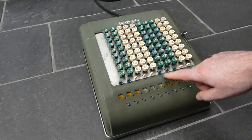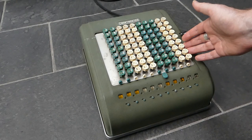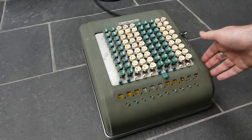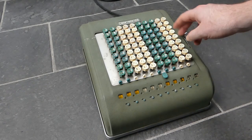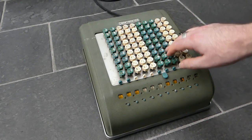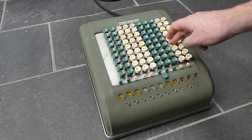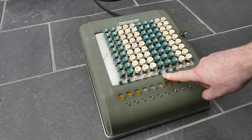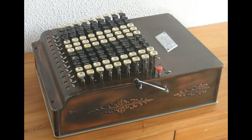This machine still has the safety mechanism that protects you against partial entries. That's a bit silly to still have this on an electric machine, but basically the mechanism is virtually the same as the manual machine. So if you press down only slightly, all the other keys lock up, and you can still press this button to complete the addition. Now that one is locked up as well, and you can release it by pressing this button. This safety mechanism has been in these Comptometers since about 1913, and that was the Model E.